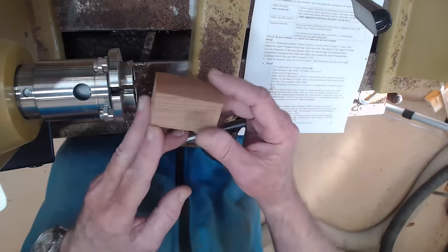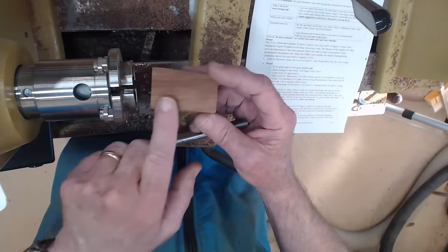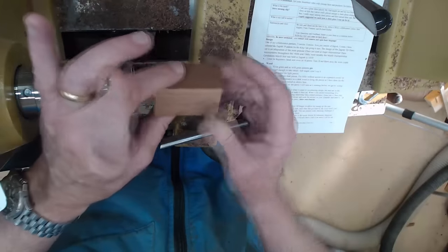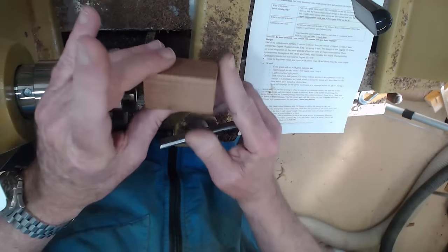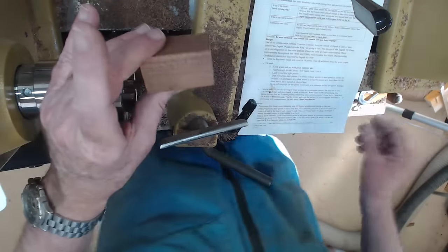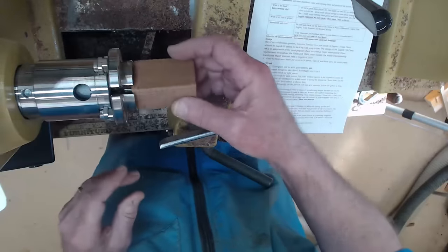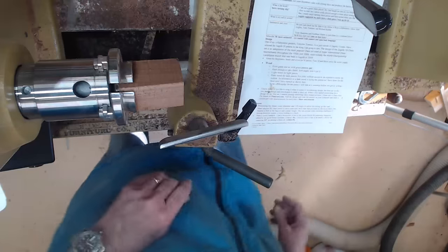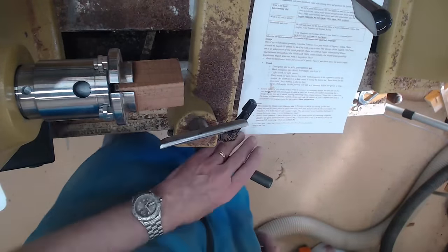It's not that hard to make these pieces all look alike. The key is trimming the wood to the exact dimensions — diameter — and maybe an eighth inch long to allow room for truing up. Many players like to have some heft to their pieces, so they wind up weighting them, and that can be a challenge for your chucking method.